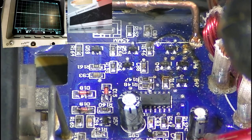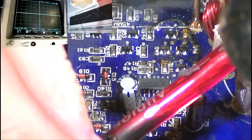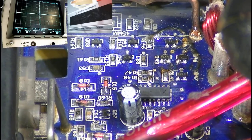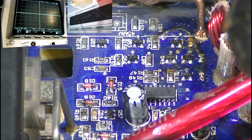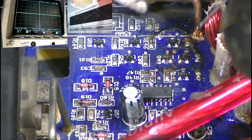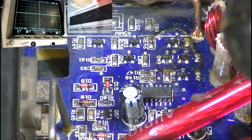And there's pin 4. So what we're going to do now is take a little piece of wire, strip the end off, solder it to pin 4, and then run it round to the capacitor positive. Get some fresh solder on pin 4 there. Now let's tin our piece of wire.